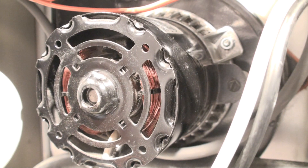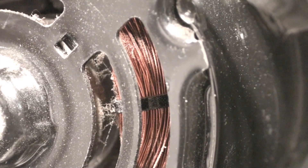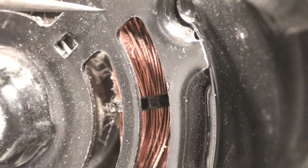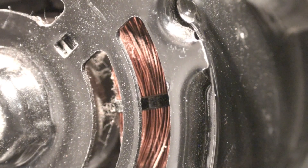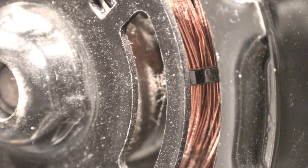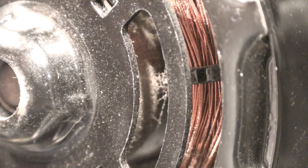You may never get the blower off the shaft, so replace the whole thing. We're going to look close at this and see if we think the bearings are okay. I'm just going to take a little probe in here and flip this thing. Looking at it, it looks like it's turning okay — it's reasonably free.